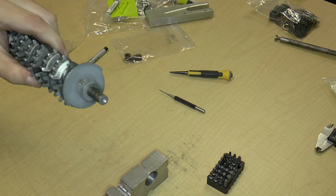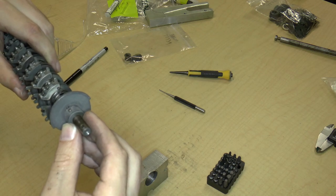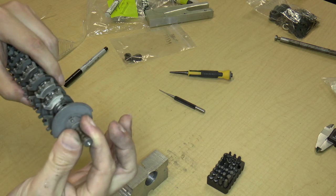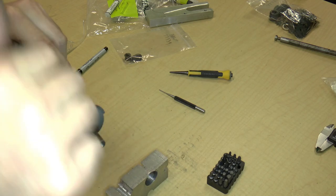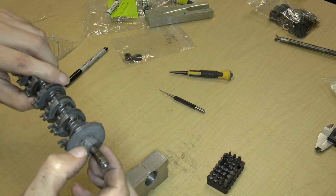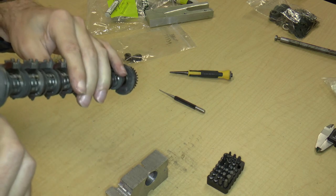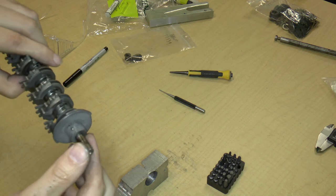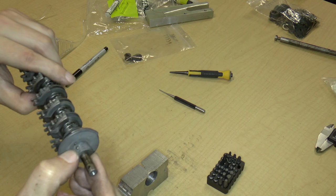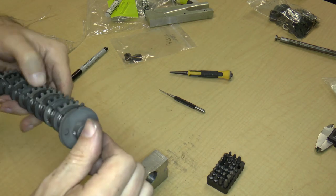The whole way that they put this on was they put the part on the axle. It didn't have any holes in it, and then they just held the part on the axle using some force, and then they just drilled straight through. So there's no way that we're ever going to replicate the exact angle that this was drilled at. So the only alternative really is to put this into a drill press or a mill, get an end mill, and just mill the sucker out.